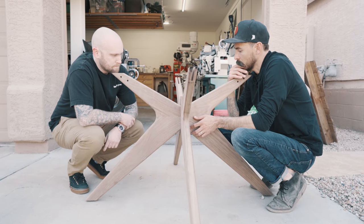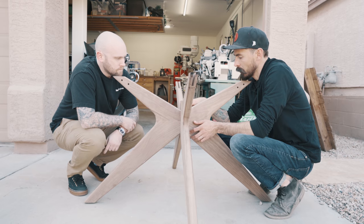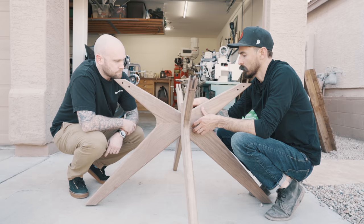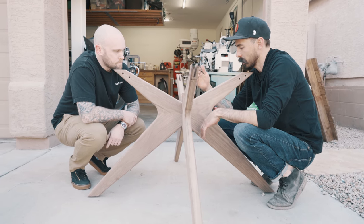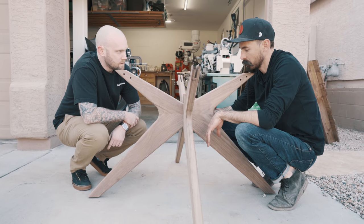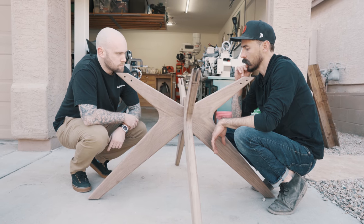What I kinda wanted to do was have your wedge sit flush on the top here. That way if it ever gets loose and we need to tighten it more, I just remove material from here so it can set down deeper. Okay. So just gradually do that. So your wedge only needs to go down like an inch to inch and a half, or so. It doesn't need to make that full pass there.